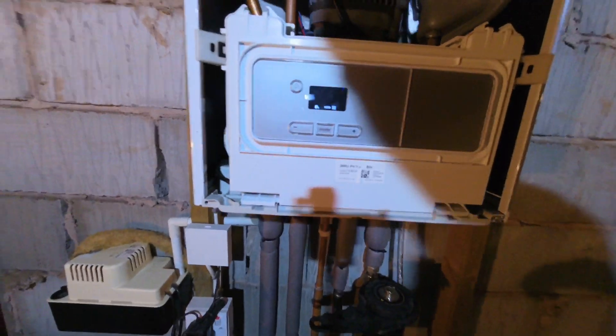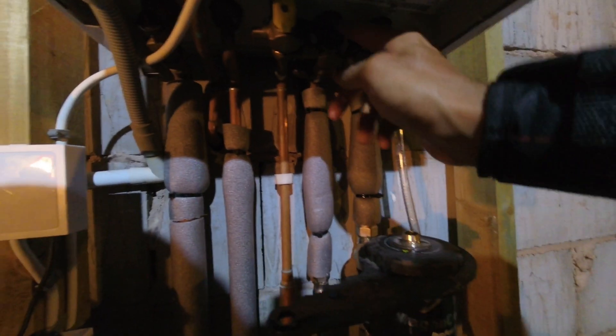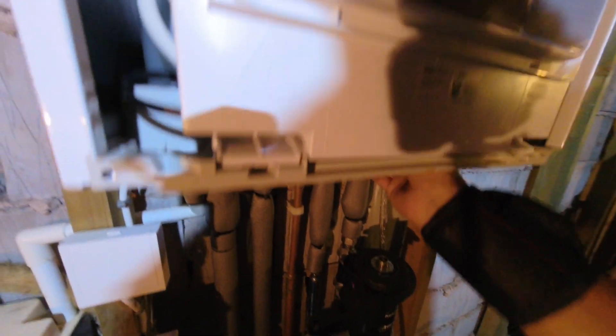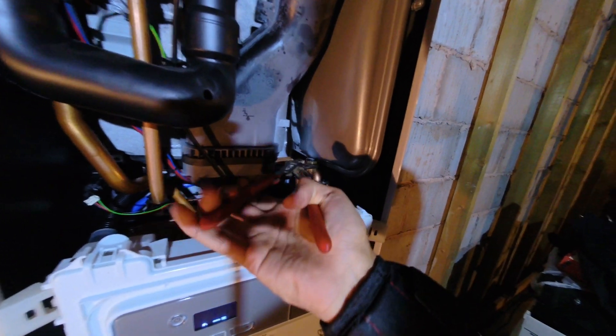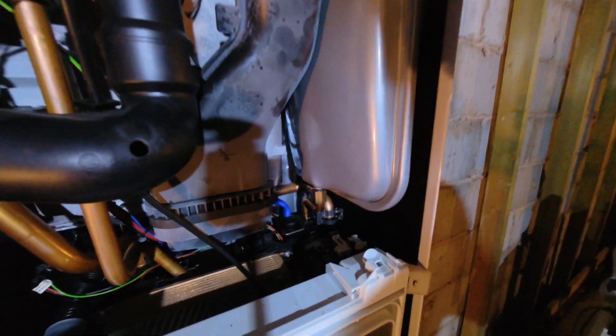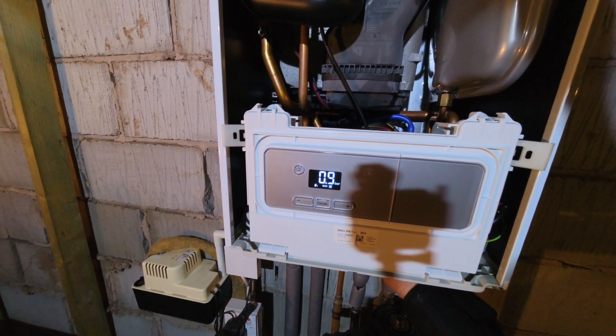The boiler is back on — that's good, meaning the pressure sensor is working and doing its job. The condense pump is just pumping out whatever was left, including everything flushed through the heat exchanger. Now I need to top up the pressure and then start purging, and clean the filter out as well. I've got to do up the expansion vessel nut quick — it was weeping slightly. That's dried up and it's not weeping anymore. Getting up to about 1.2 to 1.3 bar.